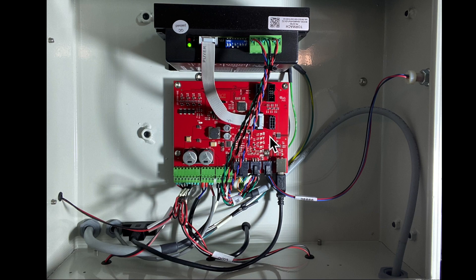These red boards are no good — we're going to replace it with a green one. The new motherboard has the stepper driver integrated right into it, so we get rid of this stepper driver and these cables. We'll unplug the three green connectors plus a couple more and the USB cable, screw the new board down, and it should only take a couple of minutes. The motherboard needs to be returned, but they said I can keep the stepper driver — and if you have the fourth axis, it's actually the same stepper driver for that, so it becomes a nice spare.